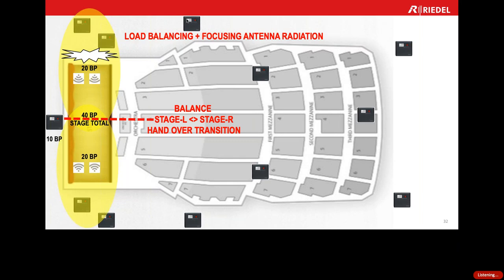So it's good to do your walk test. And if you have really strong signal everywhere, maybe try it at low power. In the menu of the belt pack, you're going to see frame error rate accumulate. If that number starts to escalate very quickly, frame error rates are a result of interference, but they're also a result of excessive multipath. So the first thing to try is ramp your power down on all your antennas, and I bet that number goes down significantly.